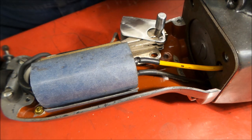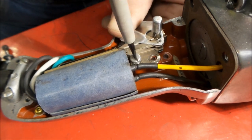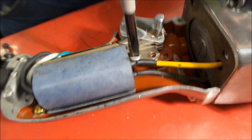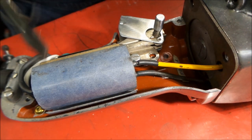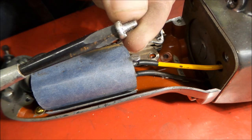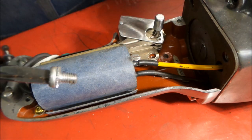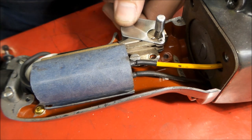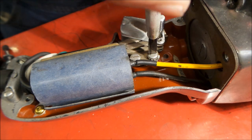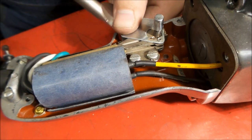So we're going to use our holding screwdriver here, get our fastener started. There we go. And once it's started, I like to take them off because they're not really meant for tightening screws, they're just meant for starting screws. So it's as easy as getting it screw on the head, sliding the handle up here with your thumb. And now you can see we're wedged. Not going to lose the screw. There we go, started. We just remove the screwdriver. Now that we got them started, we can just use a regular screwdriver to tighten them up.